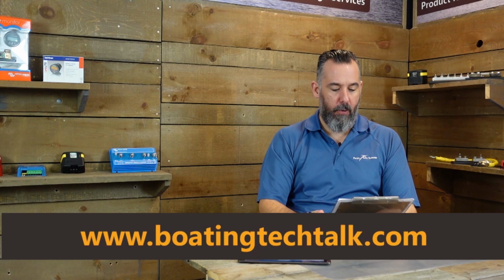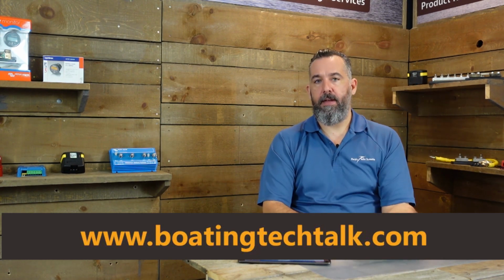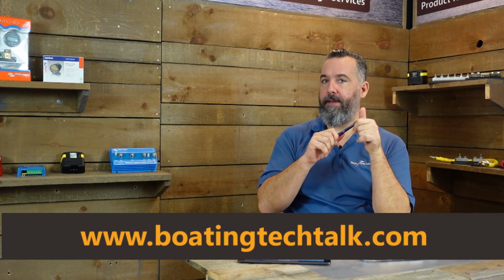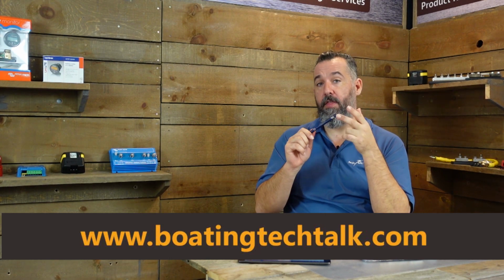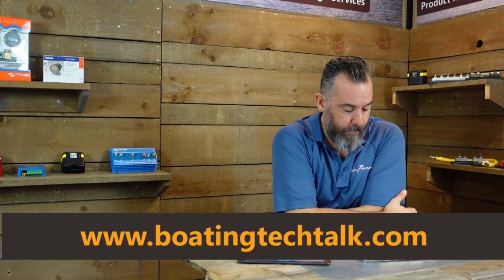Okay, so we've got a boater, Mark. Mark has three battery banks. He's got a battery bank for his engine. That's the first battery bank. Second, for his house. Third, for his windlass and thruster. And what Mark noticed is that his windlass and thruster battery bank only gets charged when the charger is energized from AC, meaning that battery bank does not get a charge from the alternator when the engine is running.